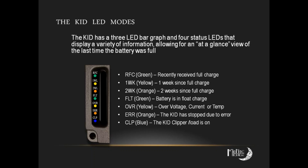So I would say it's going to current limit some, but it's not going to hurt a thing other than current limiting. We have a lot of people doing that because if you look around for a different type of module other than 60 cell, especially a nominal 12 or 24 volt module, they're a lot more money than the 60 cell modules, and a lot of people are just saying it still makes more sense. I'll lose some in the clipping, but I've gotten the modules pretty cheap, so we'll just go with it. So that's one way to look at it.